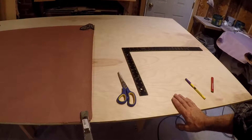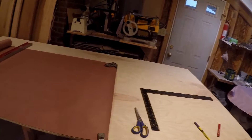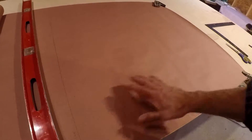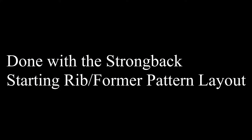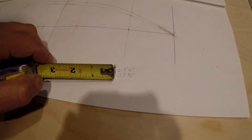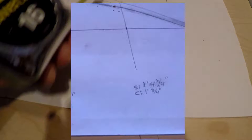I'm buying nice plywood — birch half-inch plywood for the ribs. What I'm going to do is make a paper pattern laying out at least the half shape of all of the ribs so that I can properly plan the use of this piece of plywood. We're going to start with R1. Here we've got the measurements both in the horizontal dimension in the top view and the vertical dimension in the side view that together allow us to plot out the full-size half of the shape of this rib. Here's our baseline and centerline for R1.